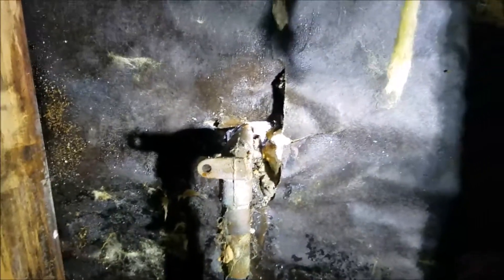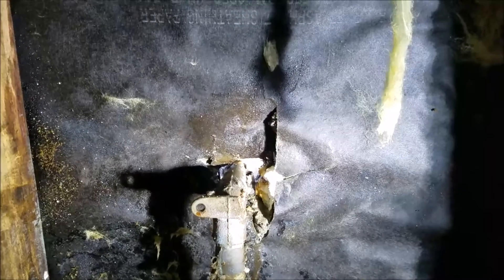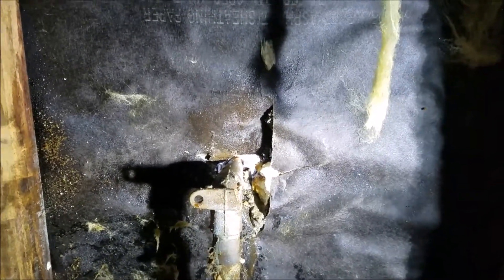What we're going to do is replace this whole thing with a copper-by-iron pipe adapter. You'll be able to thread a nipple in there and a hose bib out there, remount it, and then we'll be done. We'll take a video when we get done.